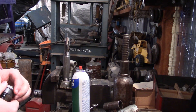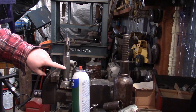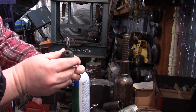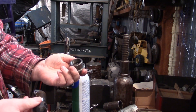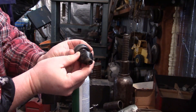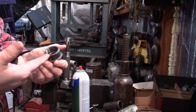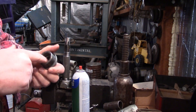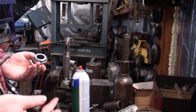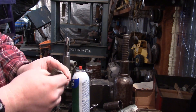After seeing how when I tried to take this piece out on this jack here it actually started crushing the pipe, I'm going to assume that's some pretty soft stuff and should thread easy. My concern was how am I going to get the pipe fitting through this — when you look at it from the top, it's obviously not going to fit. So I flip it over and think, is there something I could grind? Will it interfere with the old threads? I could take a drill press or a burring stone and grind out, but I'm just going to chuck it in the lathe. I don't see this causing a weakness because once this is thread tight, even if it's expanding, it's going to expand up into these threads anyway.